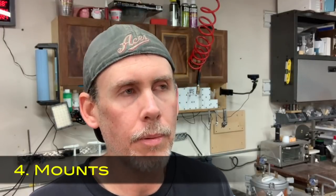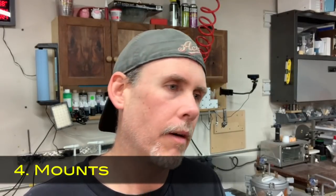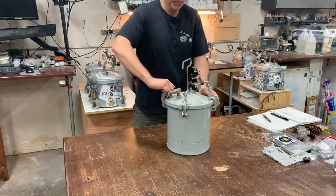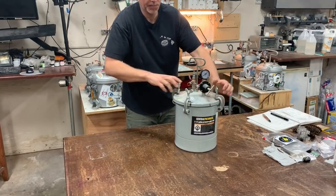The other thing I really like on a pressure pot is bracket feet - little brackets welded onto the bottom sides. You can mount wheels on your pot, but I use those brackets to mount the pot down to a tabletop surface. When it's mounted and can't move, the pot won't spin around on you when you're tightening the clamps. If it's just sitting on a desk with nothing holding it down, it tends to spin around when you're trying to clamp the lid - especially when you've got resin starting to set up and you need to get it in there quick and get pressure applied.